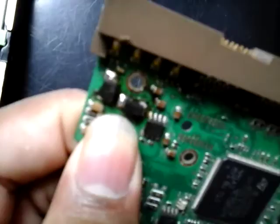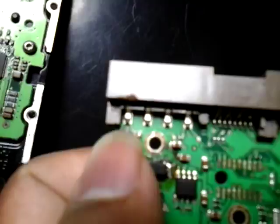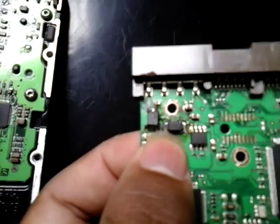Just use a small amount of solder lead — it's perfectly soldered. Remember: the dash mark on the diode should point toward the symbol or plus symbol. For the 5-volt diode, the dash mark also points toward the plus mark or the symbol — don't forget that before soldering. The big diode is 12-volt and the small diode is the 5-volt TVS diode.